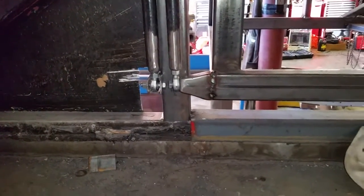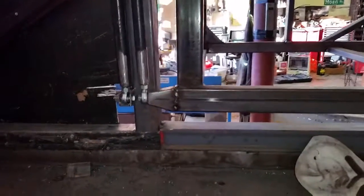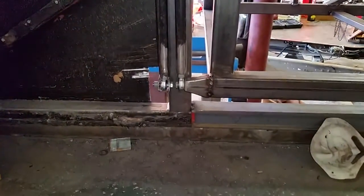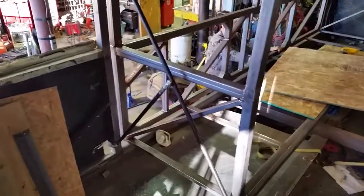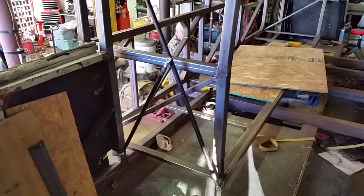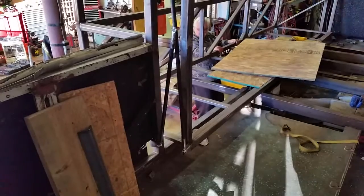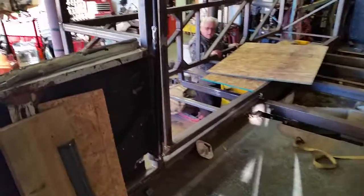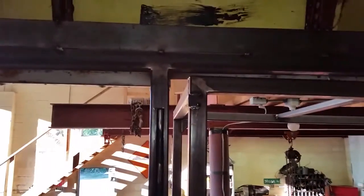When it's out it's holding it in the right position, so it's right. Anyways, trying to figure that out - it all works nice and smooth and does what it's supposed to do. Somewhere along the line I screwed up in my geometry and I don't know exactly where. So pops is going to pull it in and out - we'll just pretend he's a hydraulic cylinder - and it all works nice and smooth but it just picks this corner up, I'd say darn near an inch.